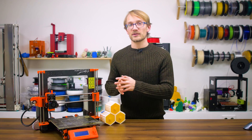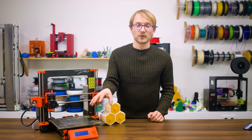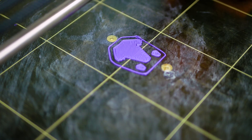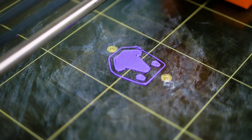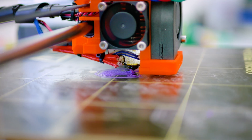With these things covered, you're basically ready to start a print. As soon as the first layer starts, pay attention to how well the lines stick. If you can already see individual lines lifting or curling inwards, chances are your print is going to fail down the road. The same goes for the nozzle digging through earlier lines.